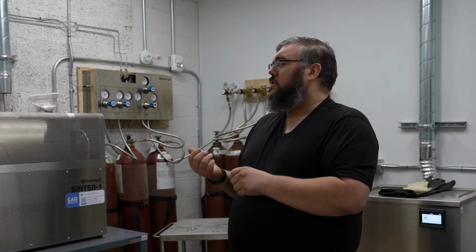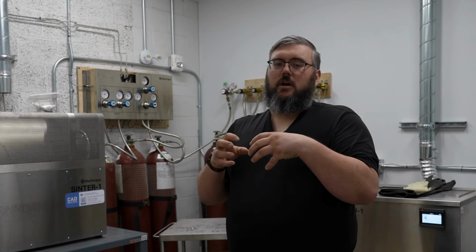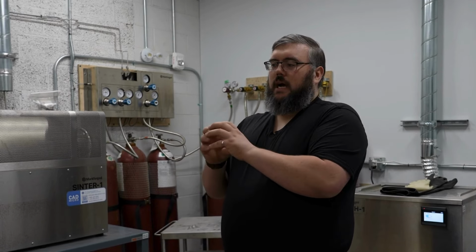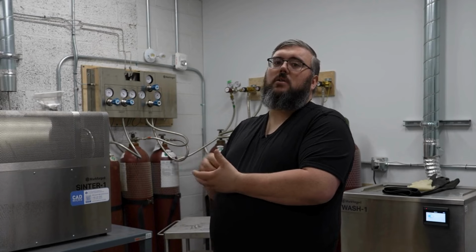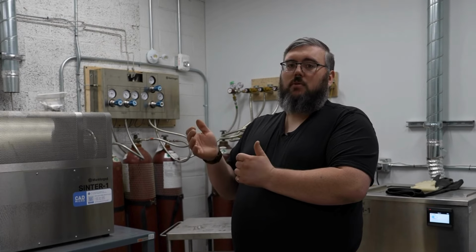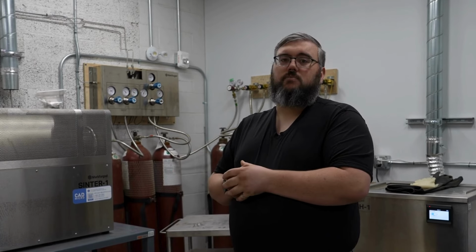The other thing we can do by going through a process of making sure that we don't need support on interior geometries is make parts that aren't possible in traditional CNC machines. So if we have a largely enclosed structure where we want to have cavities and pathways, but they aren't accessible from the outside of the machine with something like a drill bit or an end mill or one of the traditional subtractive tools. As long as we've added the geometry to remove the requirement for support, we can print it with this machine, sinter it, get it solid, and have that geometry right in the part and not have to go in and recreate it later on.